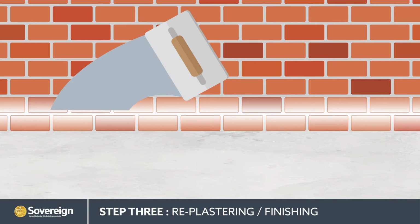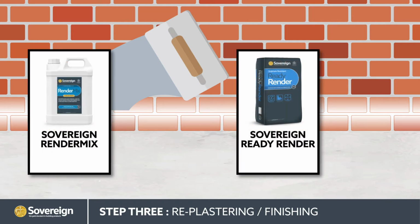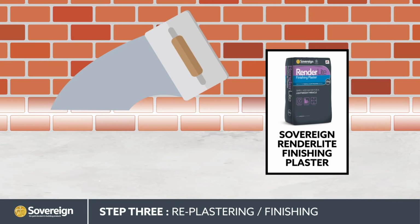This is achieved using build-out backing or undercoats of either locally sourced sand and cement incorporating Sovereign Render Mix additive, or Sovereign Ready Render, a pre-blended sand and cement mix, or Render Light Renovating Plaster, a pre-blended lightweight plaster with excellent thermal qualities, making it ideal for use where cold walls and condensation may be an issue. With each system, Sovereign Render Light finishing plaster should be used to provide a finishing coat suitable for decoration.